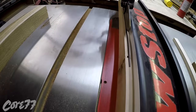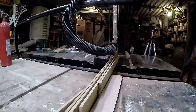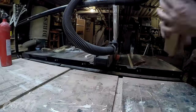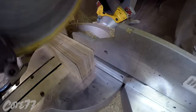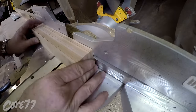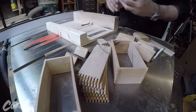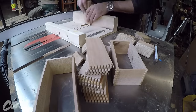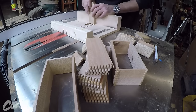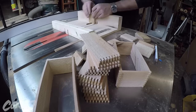Now I'm making boxes. These boxes are going to help organize the inside of the drawer, and this is a bunch of sycamore — I'm not sure because where I got it the person didn't know what it was called, but some friends think it's sycamore. I'm making small box joints; each one is going to be a three-by-six-inch box. Here's my box joint jig now set up for the regular kerf blade — I moved the rails over and changed out to the thin stopper. The quarter-inch slot is there but it's just not being used.